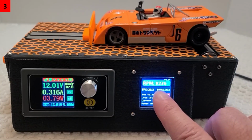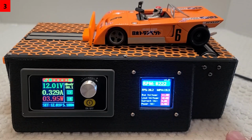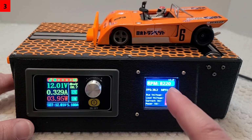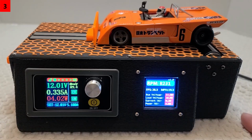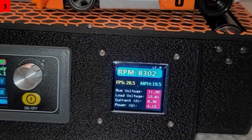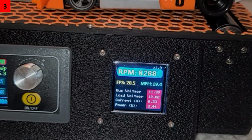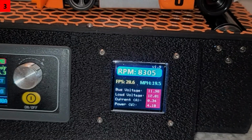Performing calculations in the interrupt loop is really not a software development best practice, but processing this way allows the TechBench to grab and report an accurate RPM reading after only 2 rotations of the roller. It does this by calculating RPM using the time between full rotations instead of a count of rotations over time. So by the 3rd revolution, you're able to see the actual RPM of your car. The TechBench gives you this information without having to wait, and in addition, this behavior is necessary when you're capturing data for charting and analysis of your car's performance.